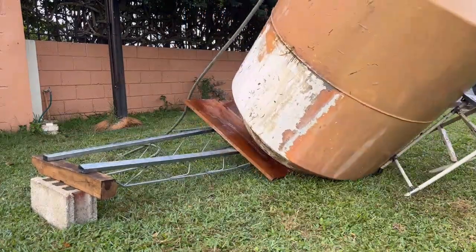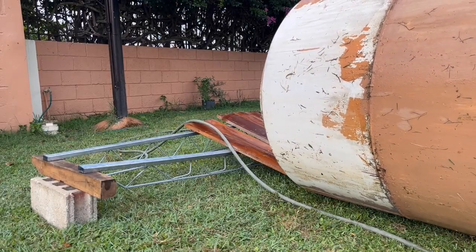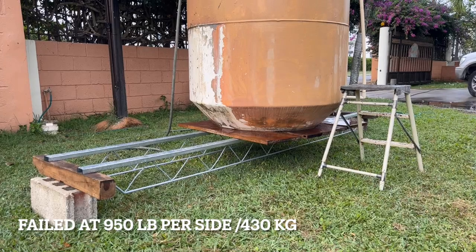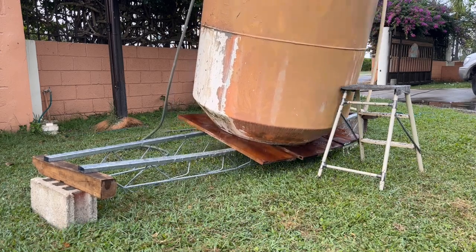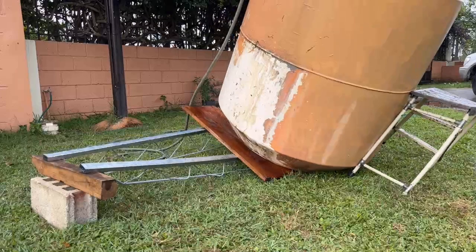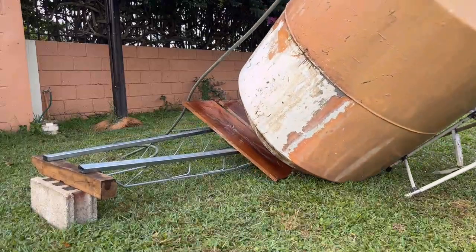This failure, in my opinion, occurred because the bars under compression buckled. If you look carefully you'll see them start to bend and buckle, while the ones under tension were doing just fine. For the next set of bar joists I decided to add a vertical bar — the same quarter inch bar — every other one. That only adds about a pound and a half to the weight but adds a whole lot of strength to support the bars under compression force.